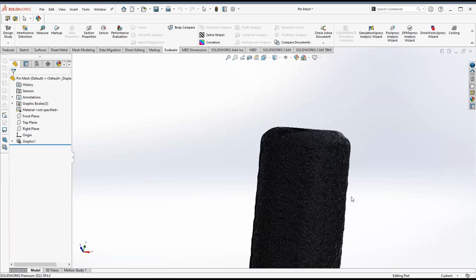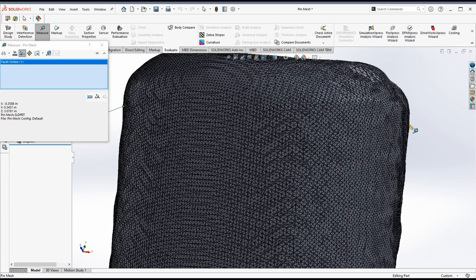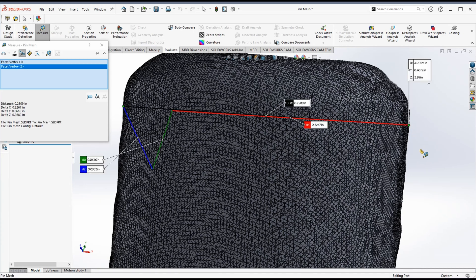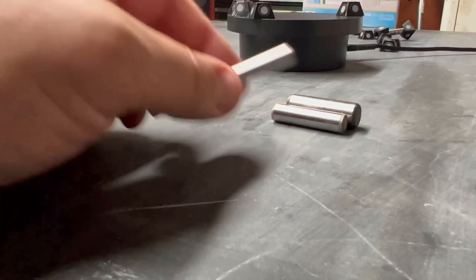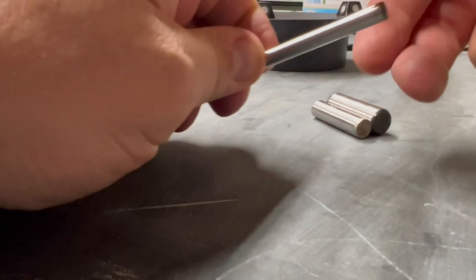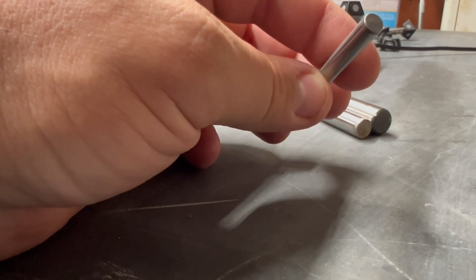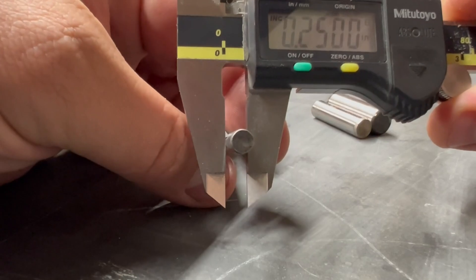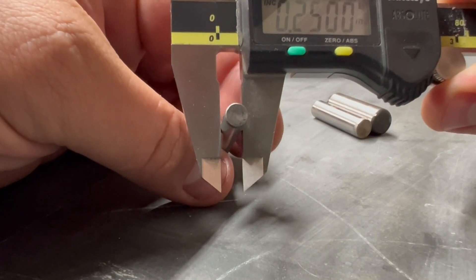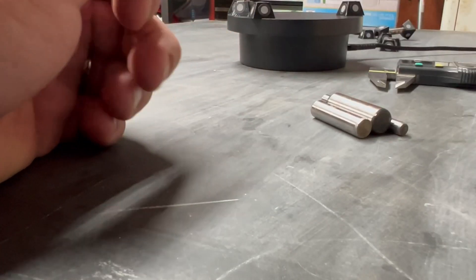Trying to get a good point here — there we go. The measurement is 0.2509. Now let's look at the actual measurements. I have the three actual pins here and I'm just going to measure the smallest one, because we're looking to see how accurate it can be at the smallest diameter. In the CAD model we measured 0.2509, and the actual is 0.250. So that's nine ten-thousandths, or 0.02 millimeters — which is exactly what they claim for accuracy, and that's what we got.